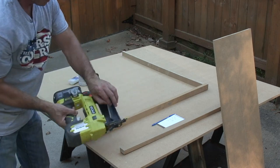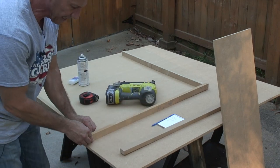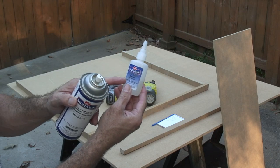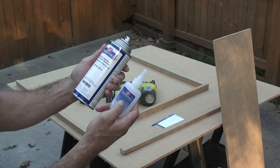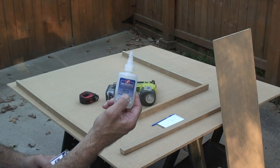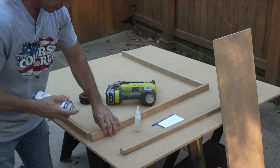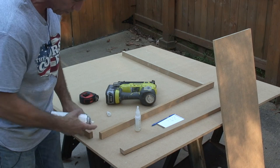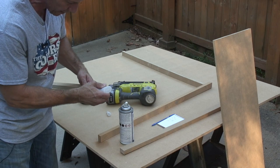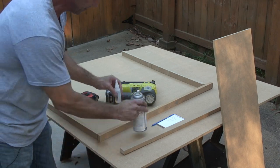I'm going to use my Ryobi gun with 18-gauge finish nails — this is an inch and a quarter nail, but you could use a six-penny nail and hammer it in, or you can use screws. I'm using Mohawk instant adhesive. Other companies make it but I particularly like this one — once I got hold of it I stayed with it. This is the activator and this is the glue. This glue is just like crazy glue but you can get it in different viscosities; this one is heavy and that's what I like to use for this. I'll spray my ends — you can spray just one end and put glue on the other, but spraying both bonds a little faster. I put glue on the end, set it in place, hold it for a couple of seconds, and that's it — it's bonded.